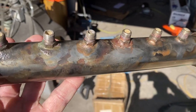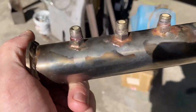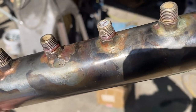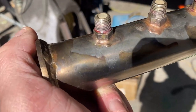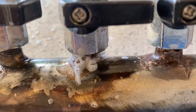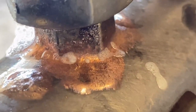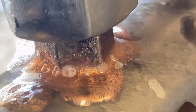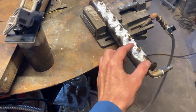Doing a quick repair to this liquid propane manifold. I used a very low silver bearing solder alloy for this job - I believe it was 15% silver - and they say you really need to stay in that 30% silver range when you're soldering brass to stainless steel. This thing has some invisible hairline cracks you can't see with the naked eye, but we were getting a propane leak, so I'm going to put some 45% silver solder on this before final testing on the boiler I'm building. I thought I'd share some things I learned about brazing.